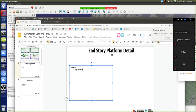Also, on the foundation, I think the short side sill plate overlaps the long side sill plate. If that matters, the wall modules on top are doing the complement of that, so maybe that's stronger than otherwise. On the bottom we wanted to bond the sill plates together, which it does. I guess we're doing the complement of exactly the same thing as on a sill plate. Yeah, so that same overlap as the sill plate.